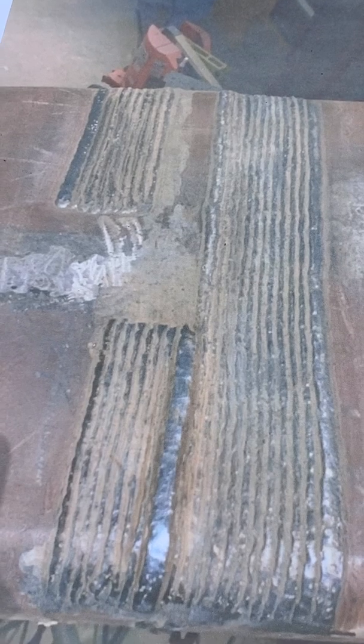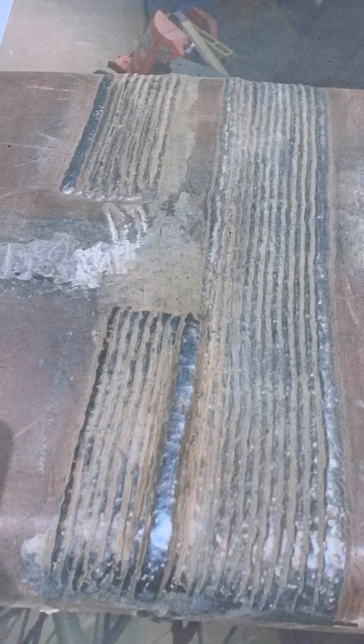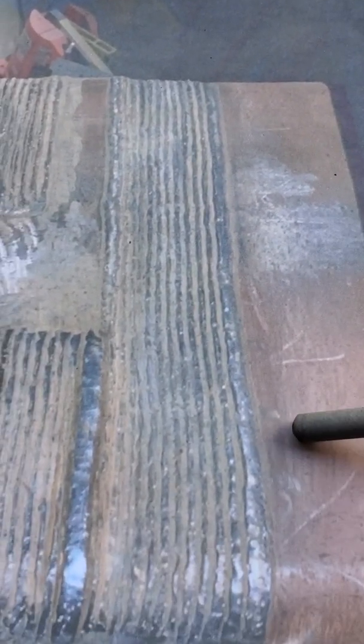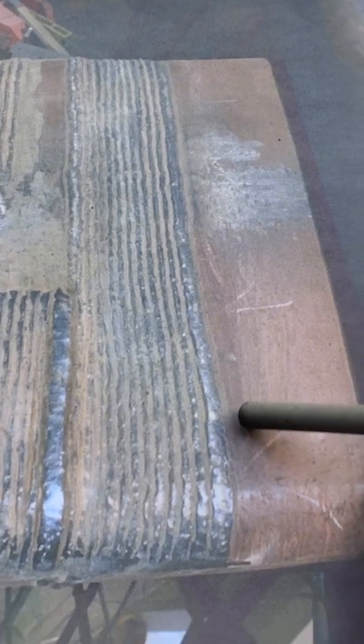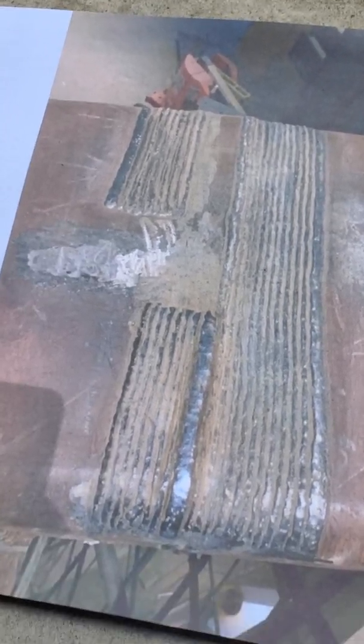He said he was at 27 volts, 200 feet of lead. I don't know what the wire speed is. Great job, B. Like I said, that's your landing. It's anchored into the embedment. That's the product, man. This is the right way to use an all-position wire when you're doing just as much overhead and vertical as flat — you know, just crank it up a little more, find your sweet spot, and it's off to the races.